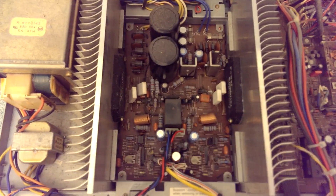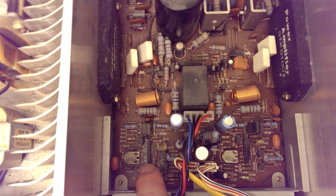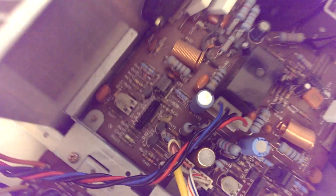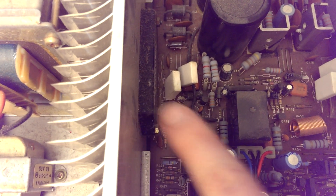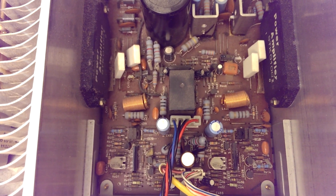Let's take a tour of some of the circuitry on the amp board — it is different than you would expect. These look like op-amps, but they're not. Despite saying IC-405, it should actually say Q-405, because you'll note G and S and S and G — that's FETs. This is a double FET: two FETs on one common die, they're gain-matched, and since they're on a common die they'll thermally track each other well, giving very low DC offset, which contributes to low distortion. Those transistors are not the drive stage — the drive stage is inside that hybrid brick. Those are the current mirrors, which help stabilize the power and lower the distortion even more.